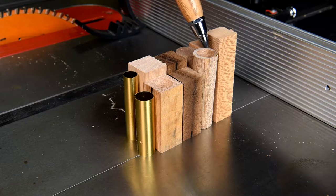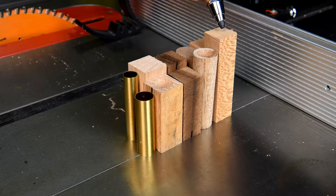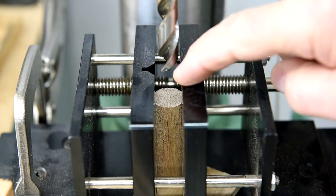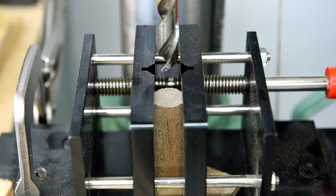The mahogany and the oak are already drilled out — well, the mahogany is only partially drilled. I'm going to wait until I get the proper bit before continuing. The mahogany and the sycamore I left long even though they're for the short tube, because I think there's a pretty good chance I'll want to put this in the precision lathe to finish it up, since it's only three quarters of an inch by three quarters of an inch — in fact slightly under. I've already centered up the pen blank vise, so it should be well centered. We'll do the round mahogany one first; these ones are the lesser diameter, about a sixteenth of an inch less.